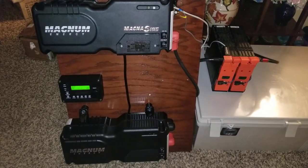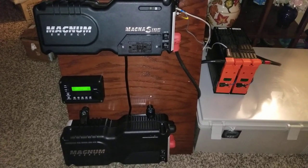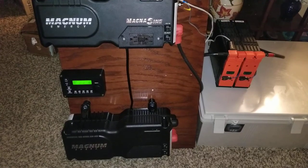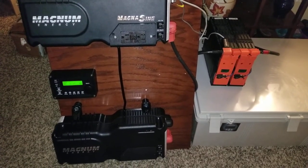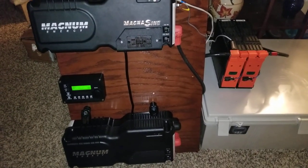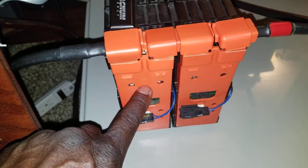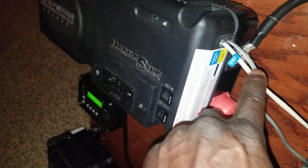The battery is all set up here for the 12-volt configuration — it's a 2S2P, 2 series 2 parallel. These batteries are 8.3, 8.2, 8.2, almost the same. The max is about 8.4, which gives a similar specification to the Nissan Leaf. So these two batteries: 8 volt plus 8 volt is 16 volts, which works perfectly for these Magnums here.